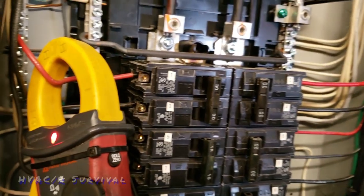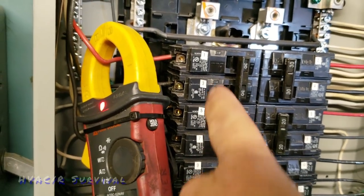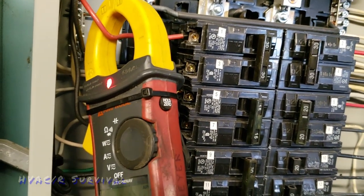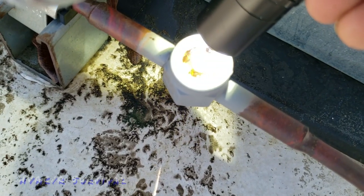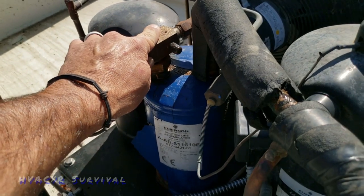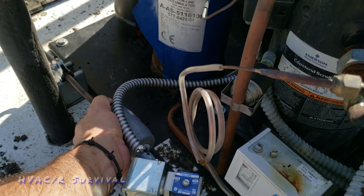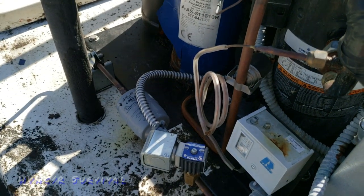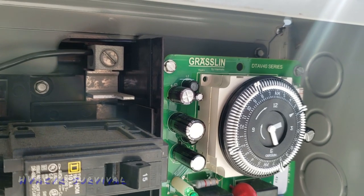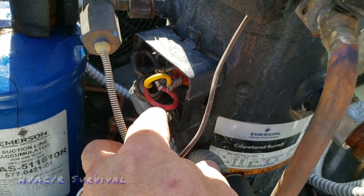I ended up pulling the breaker out of place to check behind it, made sure there were no burn marks - everything was tight and tidy. Checked my voltage drop between leg to leg and had only 0.05 volts, so less than a tenth of a volt. The sight glass is still full, suction line is sweating back nice and cold, discharge is hot, liquid is warm but not hot, both fans are running. It's 2 a.m., so it's been off for a while.